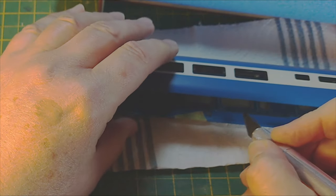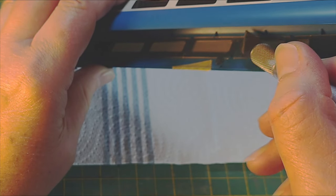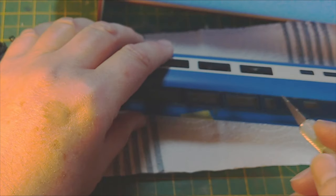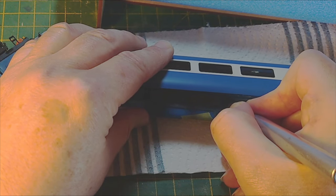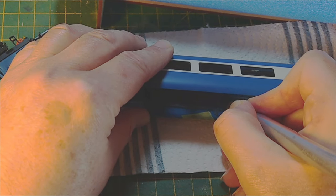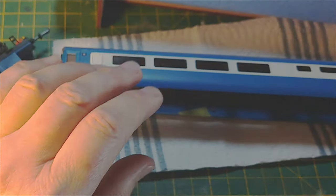You're not going to cut right through, and then harder right at the back one, at the back here. What can you see? Yeah, at the back there, just there. You'll see when it pops. Hopefully it pops out without taking other bits with it. So let's keep going. It's about 4 or 5 millimeters, the cut into the groove. Do it a few times like that.